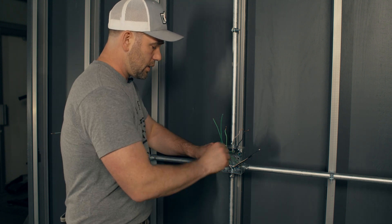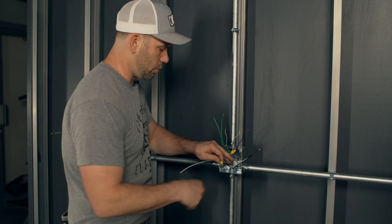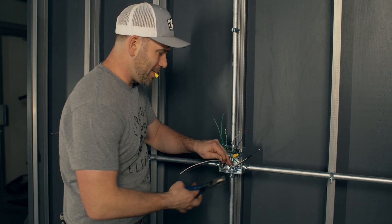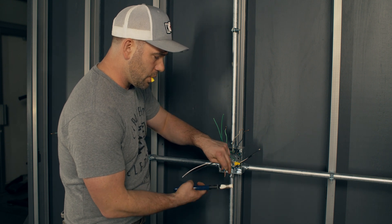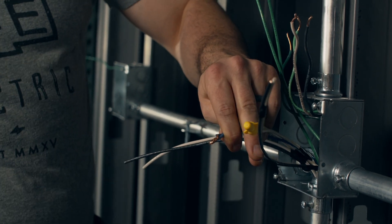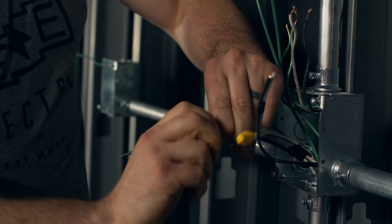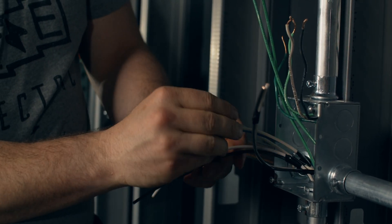Take that tape off right now and unscrew that wire nut. Rather than pushing the wire all the way down and leaving that tail, cut it right there in the middle. Look at that — nice cut. Put that on there, spin it counterclockwise until you feel it click, then twist it clockwise. Pull on it tight. There we go — that's a good connection. We've got good connections with those number 12 stranded wires.